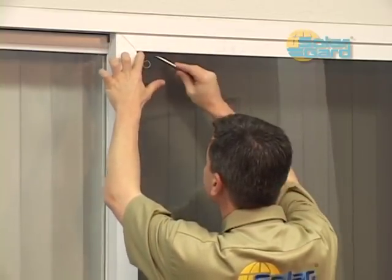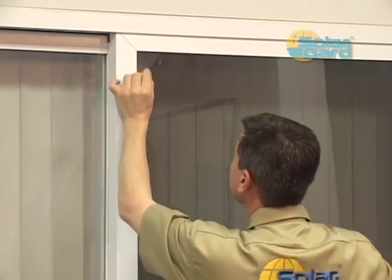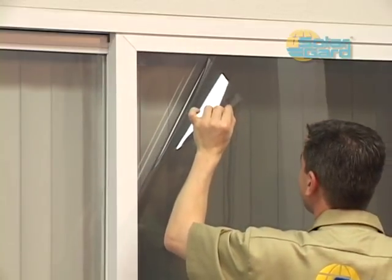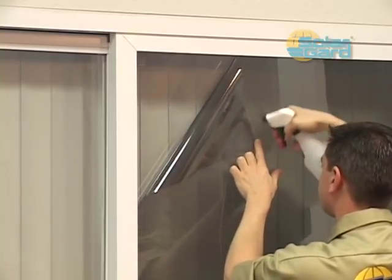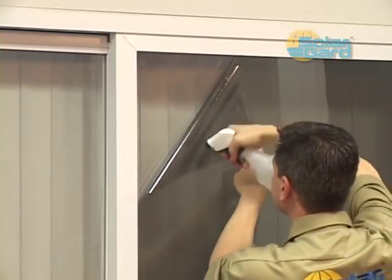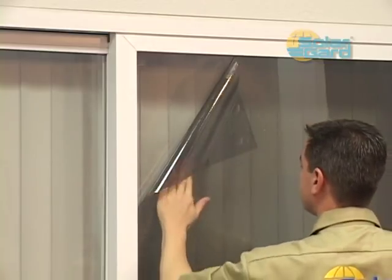Lift the edge of the film at the corner closest to the contamination. Spray the adhesive side of the film with your application solution. Then, carefully lift the contamination from the film. If the area of contamination is larger, rinse the film and lightly rub away the contamination using your finger. You may be able to squeegee off the contamination from CDA adhesive film. Respray the film and lay the film back into place.